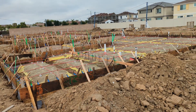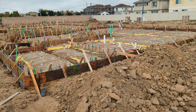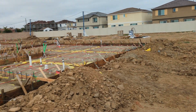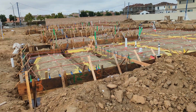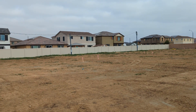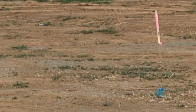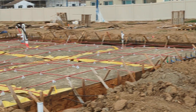I wanted to show an example of how we do building corners. A lot of times the building corners are a contract negotiation between the engineer we're normally subbed out to and the developer. We normally do five foot off the building envelope, and I normally grade one stake in the back, usually on the garage side, so it's consistent. If you're unfamiliar with what the building envelope looks like, I'll give you an example.